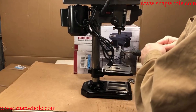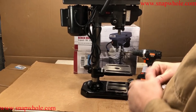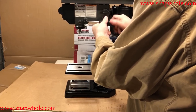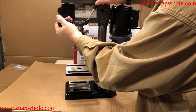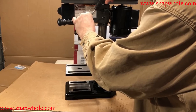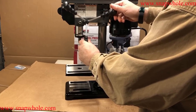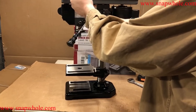This thing weighs about 6 pounds. Oh — there are only set screws on one side; I would have expected both sides. The lever arms just screw in, and you want to get those as tight as you can because you don't want them coming off in the middle of drilling. There are three of them — pretty standard, just miniature. In my opinion this is not a general use drill; this is for very light duty jobs. I wouldn't be drilling a lot of large holes with it.